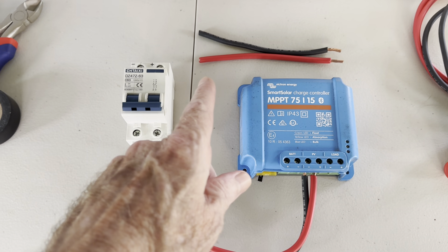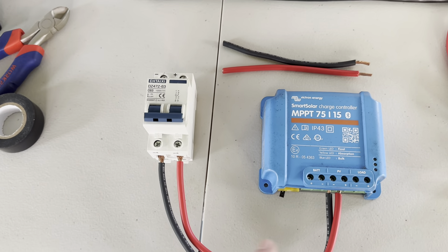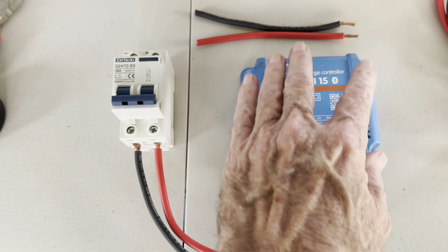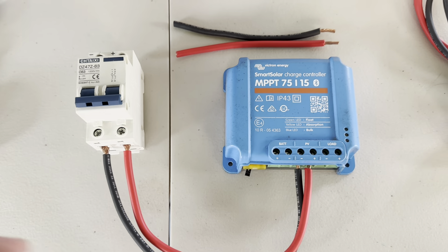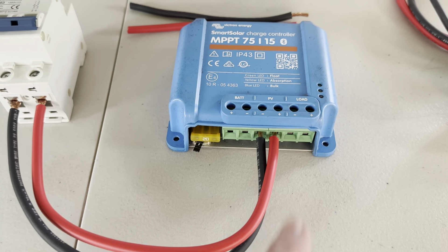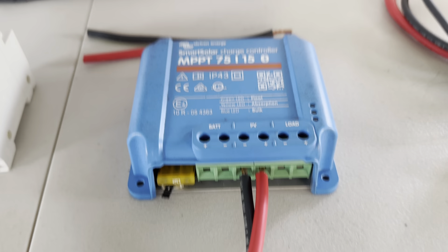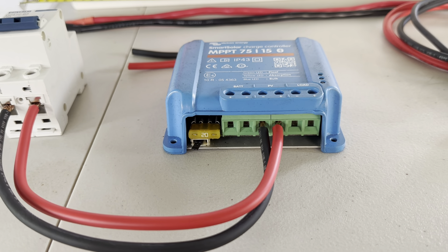That was super easy and quick — I ended up cutting about six inches off of what I had. I've got approximately ten inches or so to work with, which is about how I want it to look on the wall. That gives me a little flexibility in exactly where I'll mount it. I was going to put ferrules in, but this particular size charge controller does not accept anything I've got for ten-gauge wire — they're just too big and won't fit in those little holes. It works fine just putting the copper wire in there; it cinches down nice and tight.